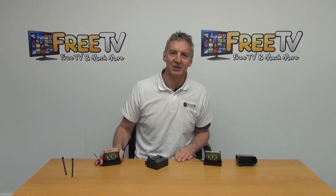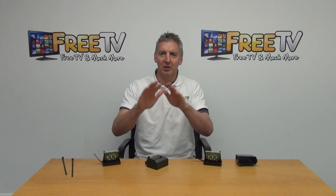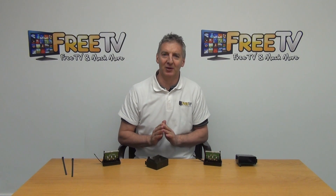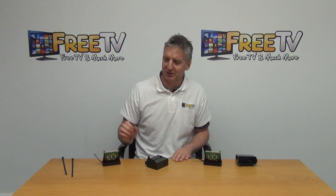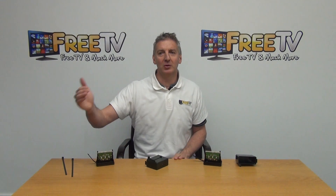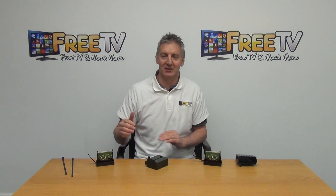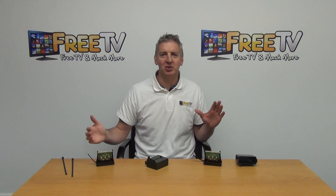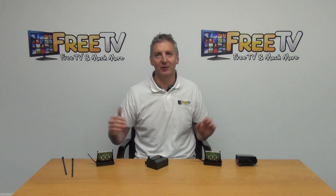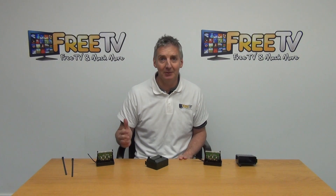What you need to do is look on the Saorview website where there's a map of all the main transmitters. If you link through, you can go to all the sub-transmitters in Ireland, find out what your frequency range is, and choose the one that's best for you. Then look to the UK or across the border to see what the other transmitter is, and determine which aerial will work naturally by itself and which will need to be amplified — and that's the unit you choose.